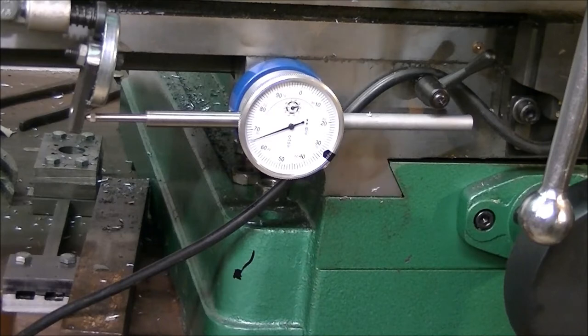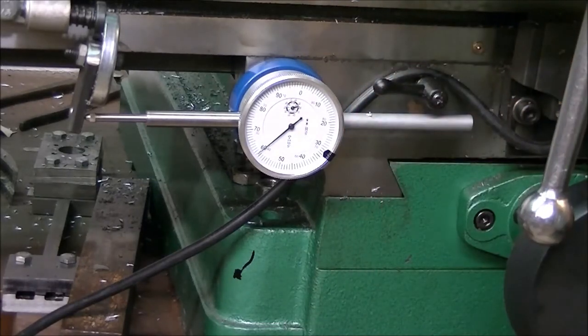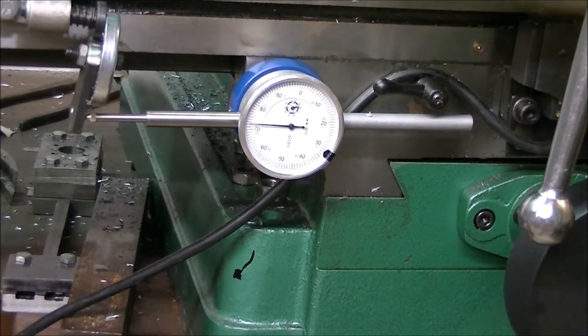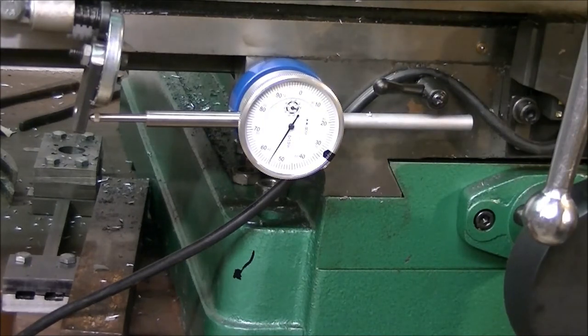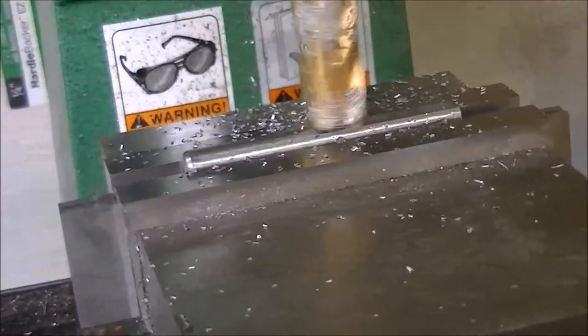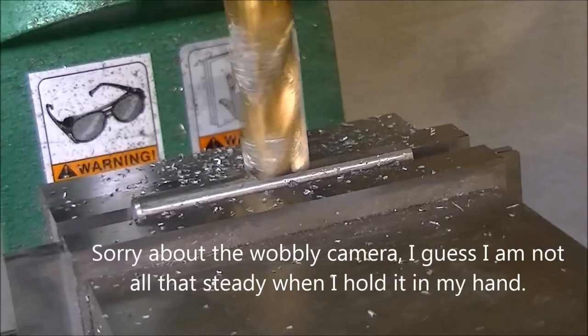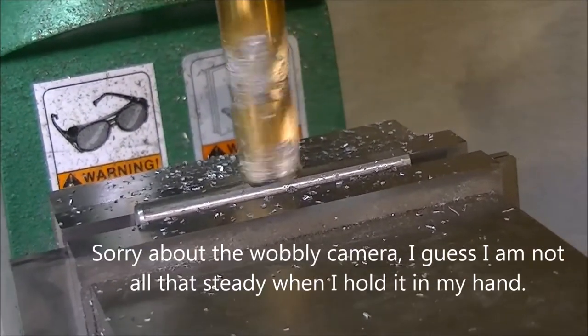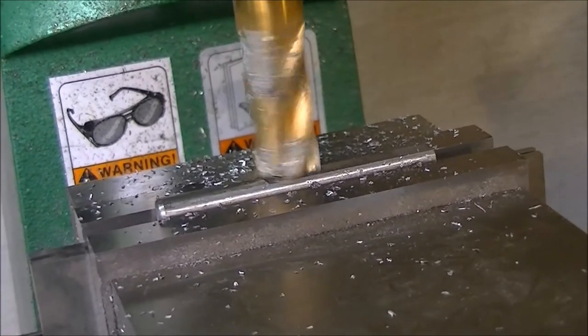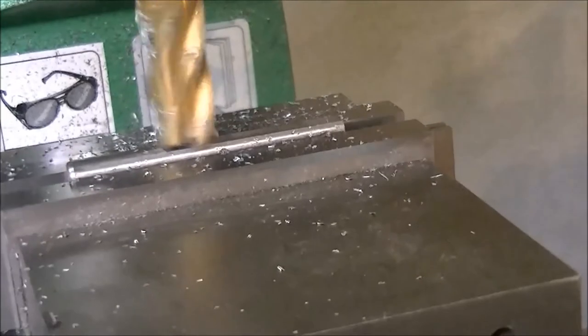I learned this little trick from YouTube — put a dial indicator down there so that when I move things around I can move exactly where I want to go. You don't have to worry about slack in the threads or nothing. It's not a DRO, but it's the next best thing. Mr. Pete used a rod with a flat on one side for the adjustment in this carriage stop. After thinking it over a lot, I finally decided to go with his design, although I had favored threading the piece in there with real fine threads. I thought I can do that later on if I really want to. This first time around, we're going to go ahead with the Mr. Pete design.